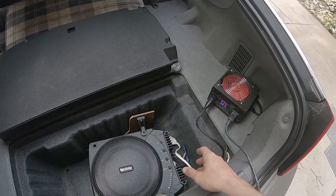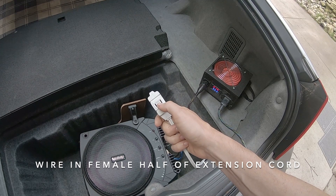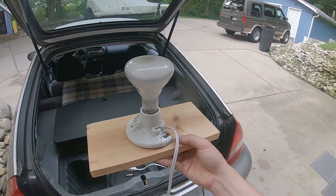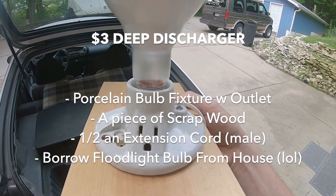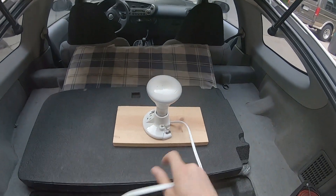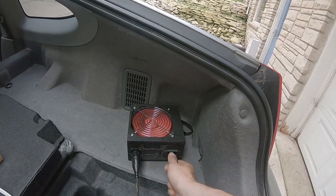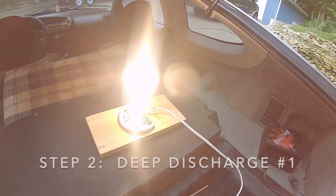In the wiring harness for the grid charger I wired in an extension cord. If you were to plug something in here, this is the full voltage of that battery — that could kill you. But this is my super high-tech battery discharger: it's a piece of scrap wood, a three-dollar ceramic bulb holder with an outlet, and an incandescent floodlight. I took the other half of the extension cord and wired it to the terminals of this light fixture. What I'm going to do is cut power to the grid charger and then flatten this battery just by plugging this in. Boom — there's the light, it's super bright.